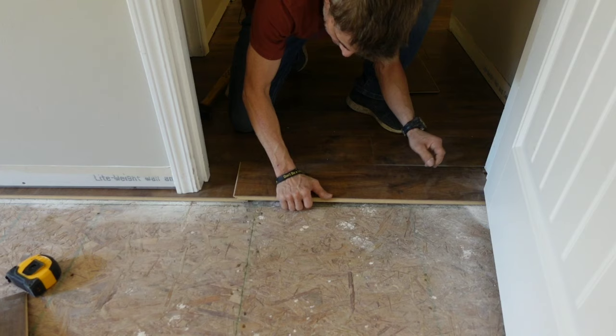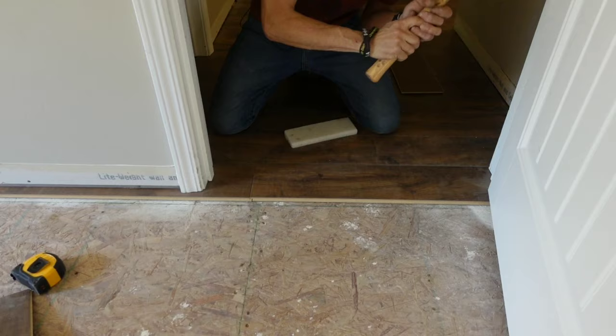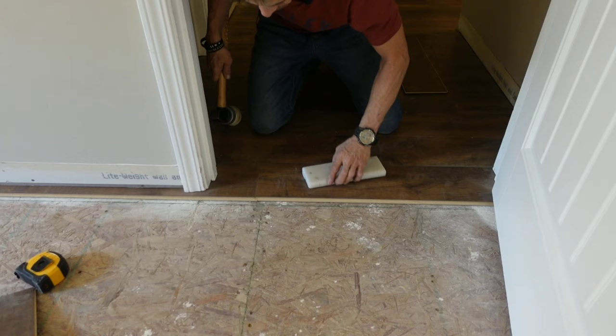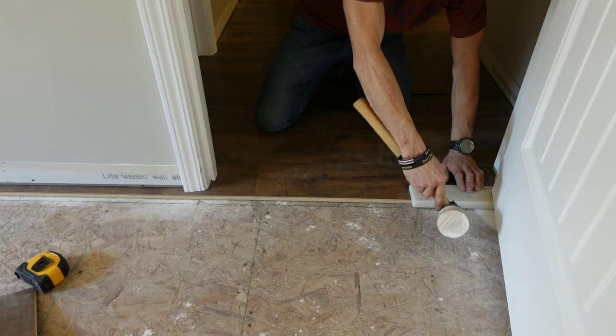There's no real easy way to put these things together. You could go against the wall behind the door and try to pry it, but sometimes that just tears up the ends. I've learned to take my mallet and smack it down slightly at an angle — not towards the end because I don't want to break the tabs. Remember, this is a tapping block, not a beater block, so you don't want to smack it hard. This hammer is very heavy, so I'm basically just lifting it up and letting it fall and letting the weight do the work. Pergo Outlast is very forgiving, so you can tap it straight in — you don't have to lift it at a 40-degree angle.